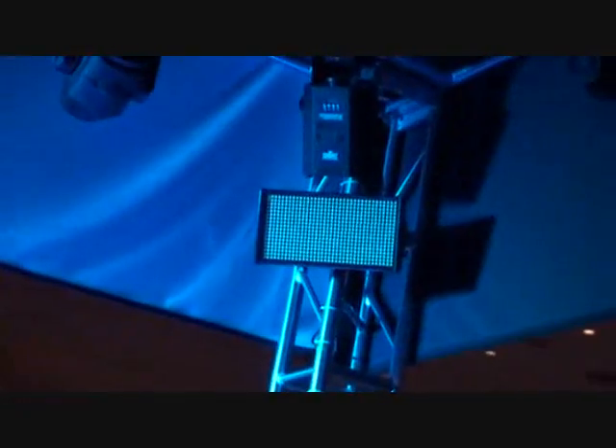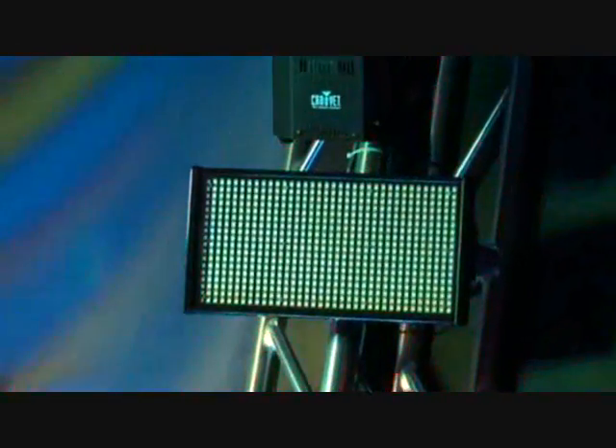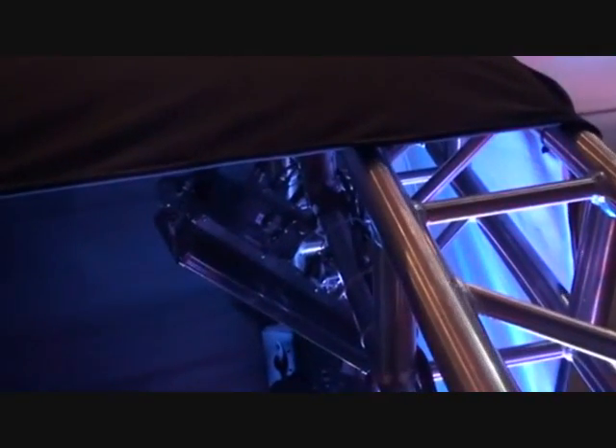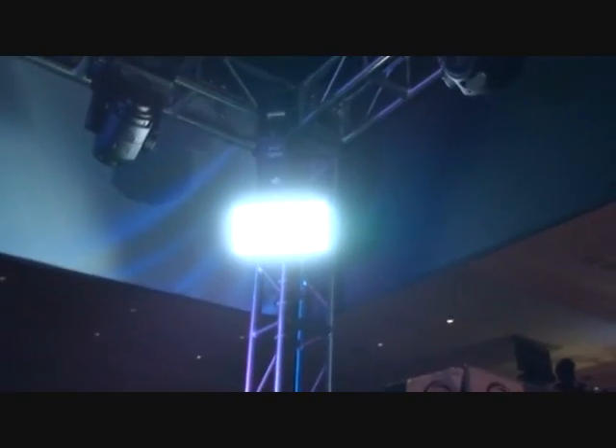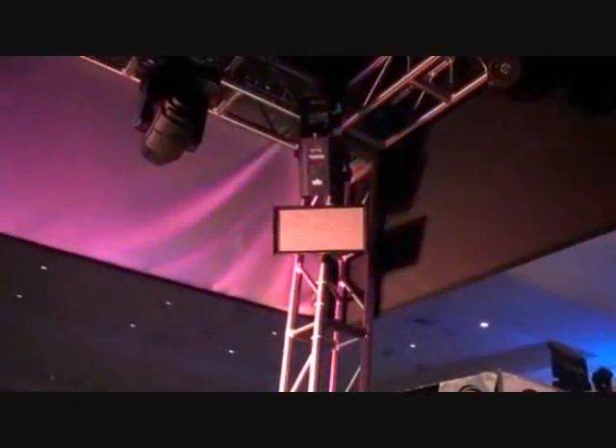This is the Impulse 648. What you have here are 648 white SMD LEDs in a panel that's going to simulate and replace your strobe lights. Pause this video now and count them. If you're looking to replace your 750-watt Xenon strobe tubes, this is going to be the unit for you. Those 750-watt strobe lamps require about 15 amps of electricity per burner, and this is just as bright and it only consumes 2 amps. So you can fit a lot more on a circuit. There is going to be a strobing effect now — so if you are affected by that, watch it. It will strobe up to 30 hertz as well.